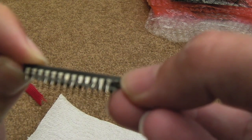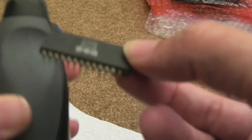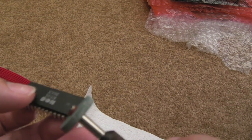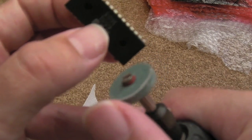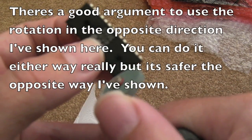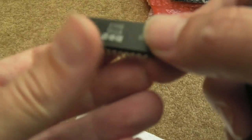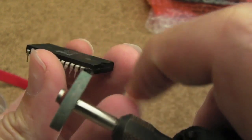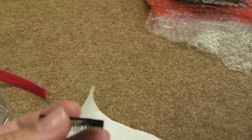What I'm going to do is see if I can get back enough metal to solder a pin. I'll use a Dremel with a grinding attachment and grind towards me — so it rotates this way. I'll start on the very top part, which looks like it could be plastic or ceramic, and grind away until we get parallel with that bit of metal so we can expose enough to solder.